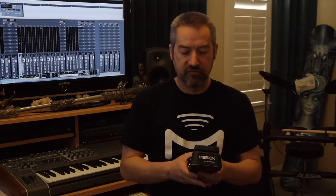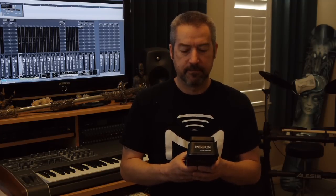On the input side, there's control for the type of pickups that you're using with the pedal. The default is set up for passive pickups, and that's going to work with most magnetic pickups on guitars, most basses, electroacoustic guitars. You'll be just fine with that. Under certain circumstances, if you're using active pickups that already have a little amplifier and buffer in them of their own, you can get some mismatch, particularly with very high output active pickups, where you may find that it overdrives the volume pedal a little bit.